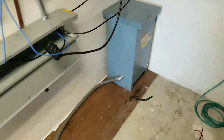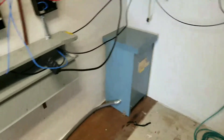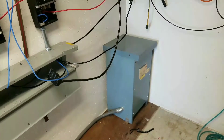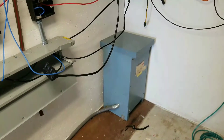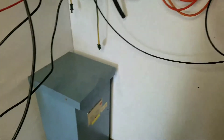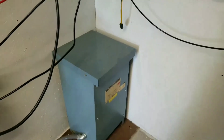So I'm going to rewire this — it's going to be a step-up from 240 to 480 volt single phase, and that will be to run power down our hill to our well pump. This used to be 120 by 240, but it can be rewired — changing from a parallel wound to a series wound to change your voltage ins and outs.